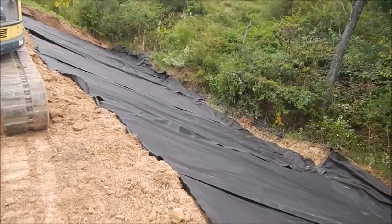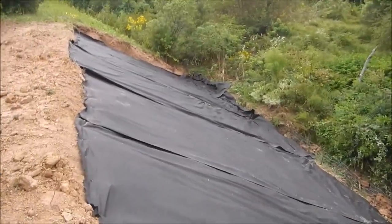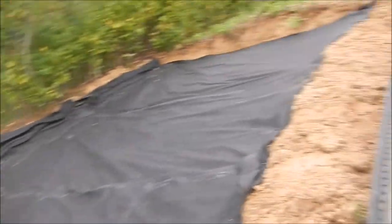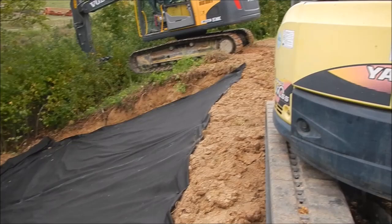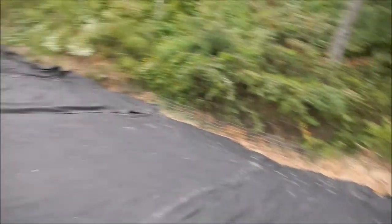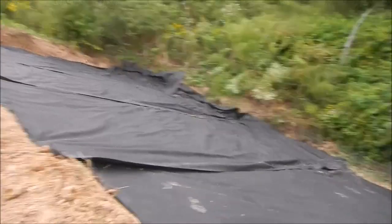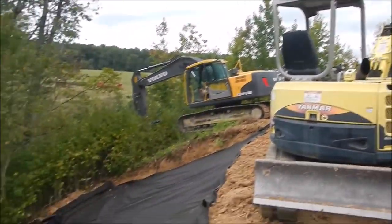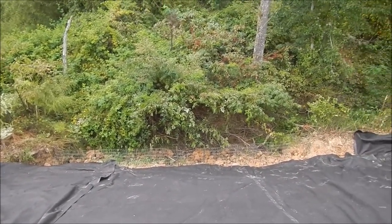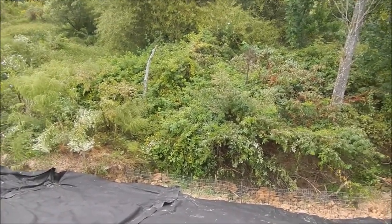All the dirt's out, we've got our fabric put in, and the first load of rock is here — the dump truck is backing up now. I had to cut this back with the Yanmar, and I'm going to build the top of this dam out a little wider where I can get the 160 back across here, since it's kind of narrow at the moment. As the skid steer brings the rock down and dumps it over the edge, I'm going to place and pack it in. Right where it butts up to the creek channel, we put some wire up to keep it from rolling all the way down and blocking the channel.